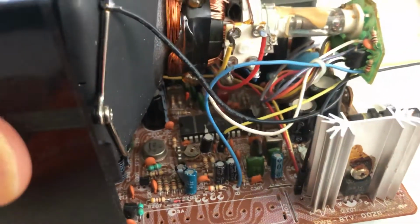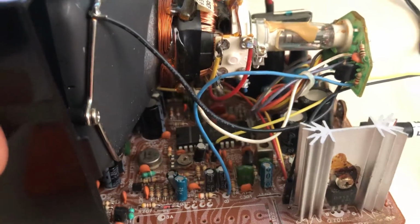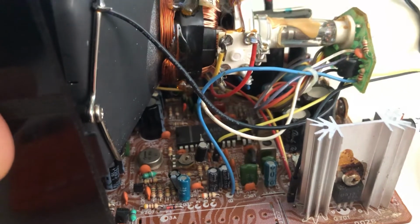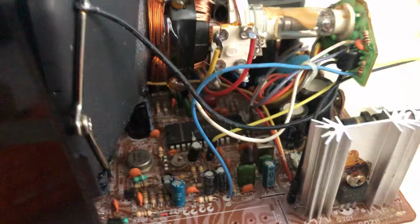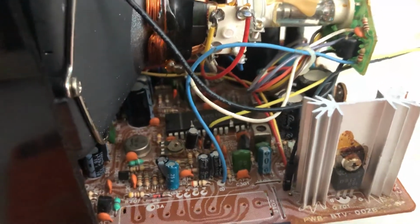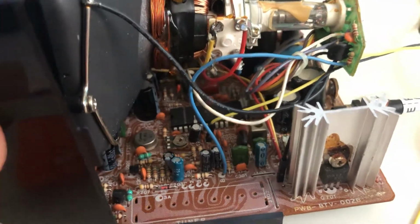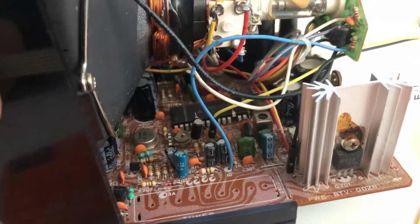Also, some later cheap $20 CRTs also had this chip, as well as much larger TVs. The chip was not specifically designed for small TVs. You can see that I've pulled out the video output chip and the audio output chip. The audio output pin is actually unnecessary on this monitor, strangely enough, because the tuner seems to route the audio signal directly to the audio subsystem rather than utilizing the audio output from the all-in-one chip.